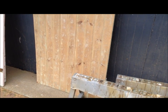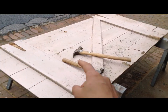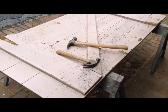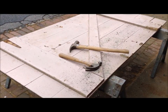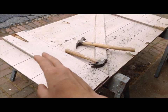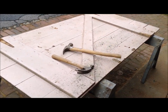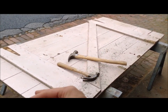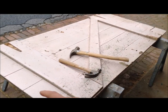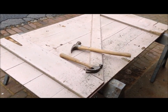This is the door I'm using for the back and I already stripped the paint off of it. The only problem is it's not wide enough by about five to six inches. This door is just paneled bead board - tongue and groove bead board put together with slats on the back to hold it in place. That angle is supposed to keep it square. So I'm just going to remove all that and add in another piece of bead board in the center to get some width.